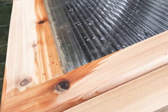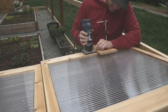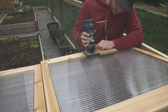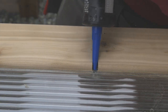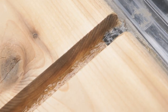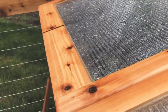Speaking of unforeseen problems, one arose later that night and presented itself the next morning. We had a bit of rain, and I didn't properly plan for drainage on top. In an attempt to mitigate, I'm going to route a relief channel on the eave edge. To be clear, this is a poor substitute for properly planned water management. After routing, I placed a small piece of caulk backer rod between the polycarbonate sheet and the frame and ran more clear sealant over everything. After another rain, take a look at the corrected versus uncorrected side — at the moment it appears to be working.